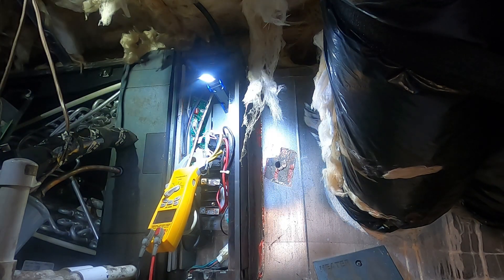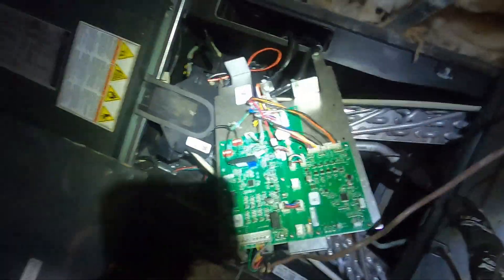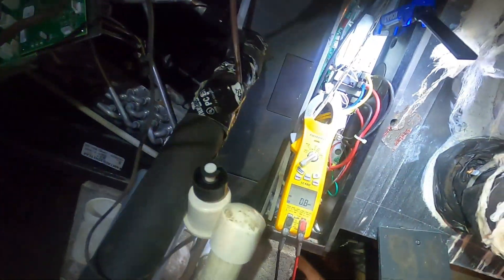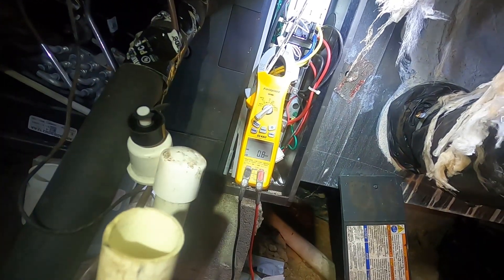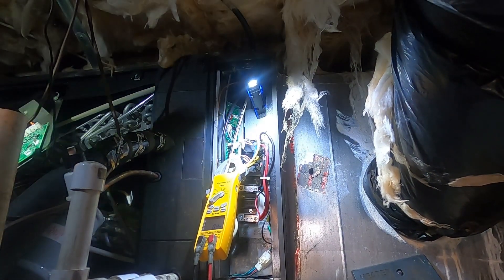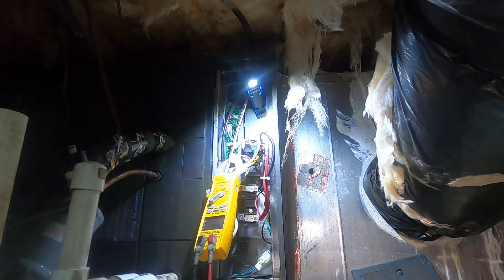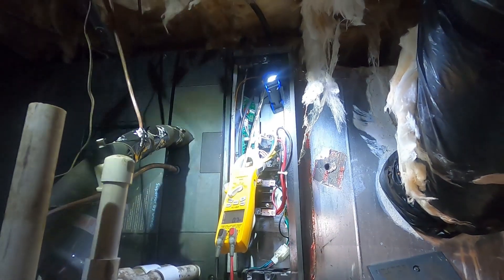Let's energize G and get my blower running, because I always like the blower to be on. Now this door is open so most of that air is bypassing — this is positive air on this air handler. Let me slide the door back in and go ahead and shut it so I've got full air flow through those strips. I just like to make sure I've got full air flow through there when I'm messing with heat strips. So let's jump them out and see what happens.